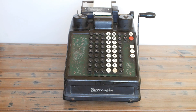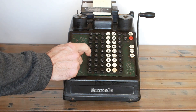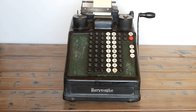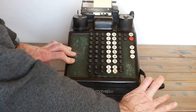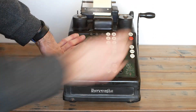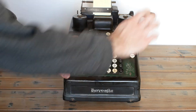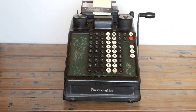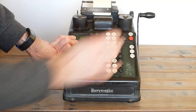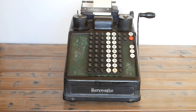A quick first look at the Burroughs adding machine. It's the old Sterling version. You'd enter your amount of money, pull the handle and it would show that amount. If you hit subtotal, it'll show you the current total but keep the total in the register. And if you hit total, it'll show you the total and clear it out of the register. But in this case it's not clearing when you hit total. It's absolutely full at the moment — 999.19.11. So at the moment something's sticking, so the next thing is to take it apart and have a look.